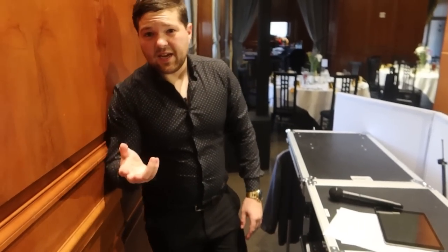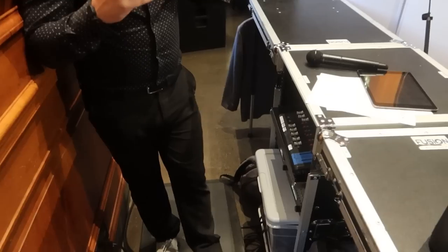And then beyond that, just making sure that you don't have your speakers cranked all the way up to the point where they're gonna feed back as well. You can take an extra step and get yourself a DriveRack PA2. It has anti-feedback suppression, which is good in certain situations, but for the most part, we actually never use it. On occasion, we'll turn it on if we have someone that's doing a toast with a very low volume, or they're holding the mic down here, even though we told them to hold it up here.